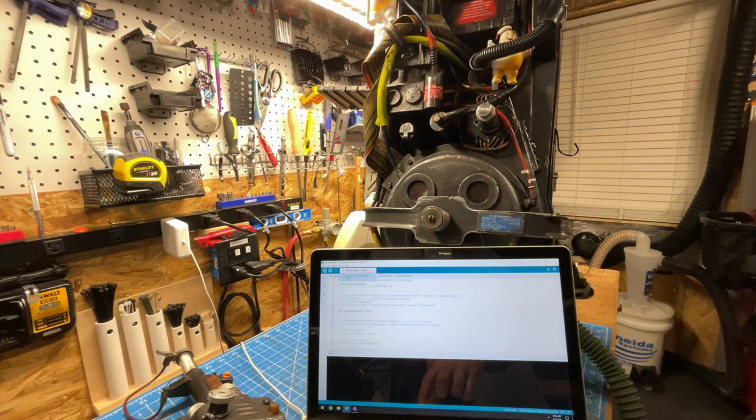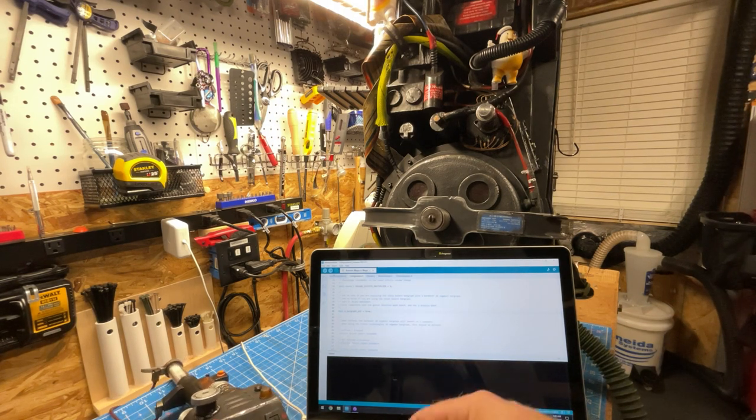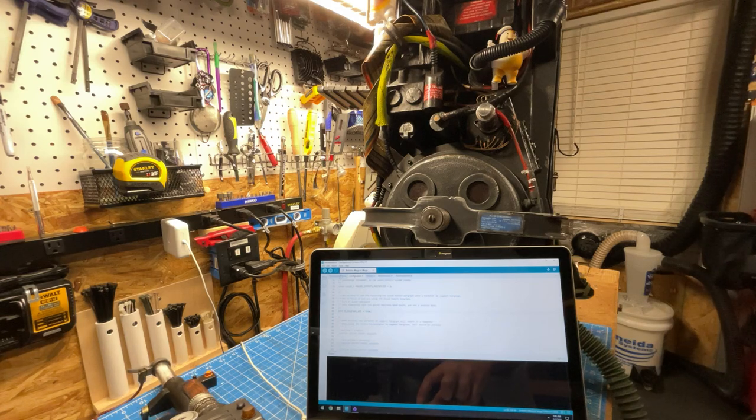So as long as that board and that COM port are selected, what you'll then do is open the Neutrona Wand .ino file. That will open up all of the other .h files. If you have any customizations that you want to make to your wand, you would do that in the configuration.h only. There are built-in comments that explain what each of the settings and options do. If there's a variable number that can be chosen, there should be some explanation as to, if you want to change that number, what does that do?